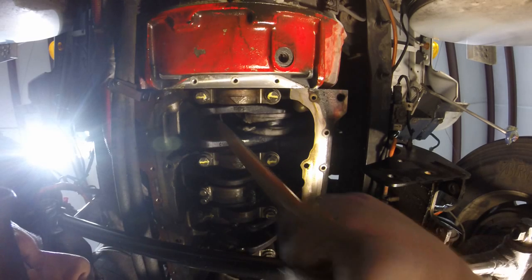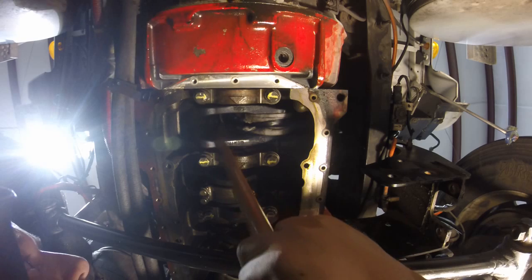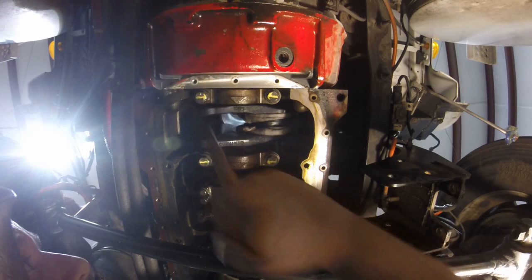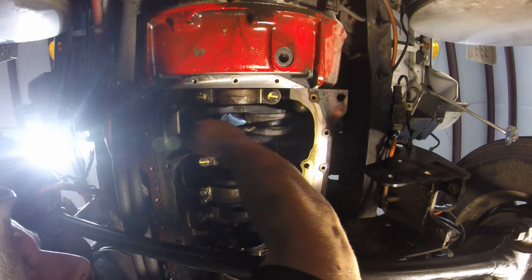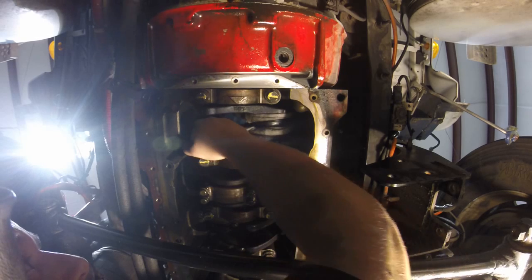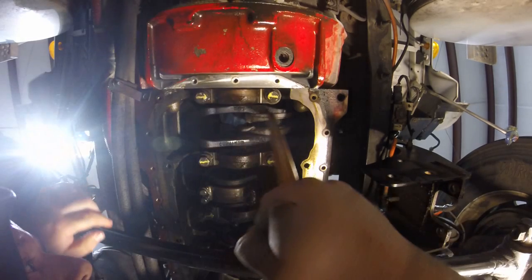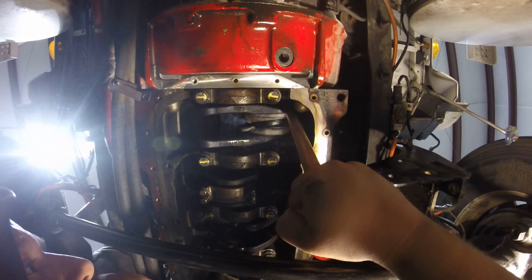So what we're doing here, we've got rods up there putting oil inside of the cylinder liner. I'm going to drop the piston in rod first, and this is where I'm going to use this stick. I'm going to get on the opposite side of the crank and guide it in, make sure it doesn't just slam down into the crank, which we have this protective wrap around here. When we get down closer, I'm able to align it better — we'll yank this off last.